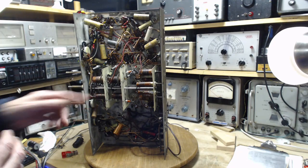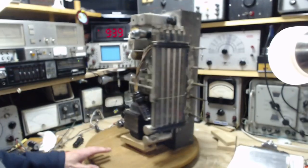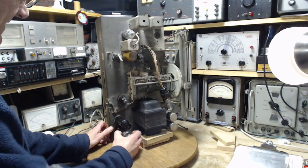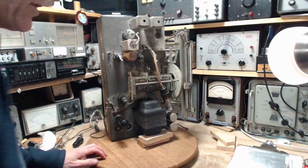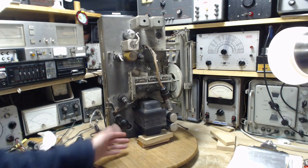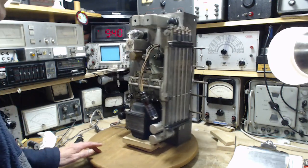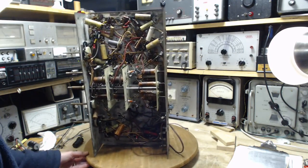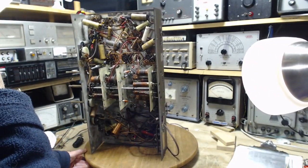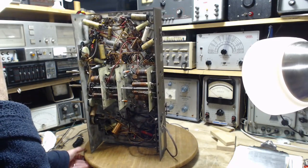The only other solution I need is how to make the speaker operate. I don't need the field coil since I won't be running the high voltage power supply. To disable the power supply completely, I'll pull out the rectifier tube. With the field coil missing, there's no chance of the radio developing B+ on its own — the only source can be something external like my power supply.